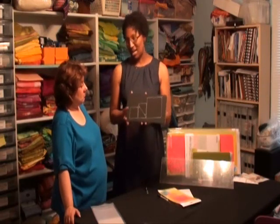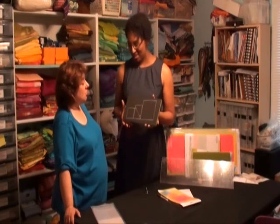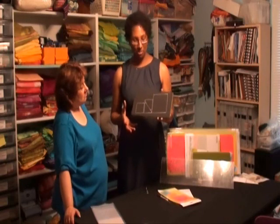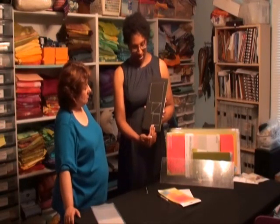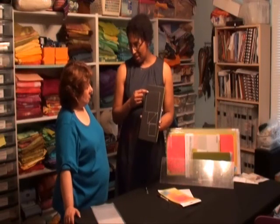The other thing about this die that you'll notice — it's crooked. It's crooked on purpose. And the reason for this is that they angle the dies in the board so that when you're cutting, you're only cutting a little bit of the blade at once. If it went in completely straight, you would be flexing the blade.